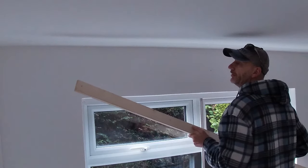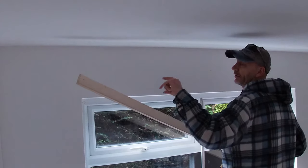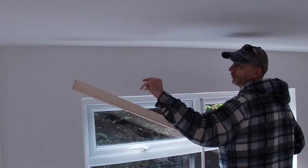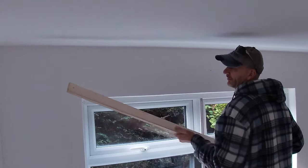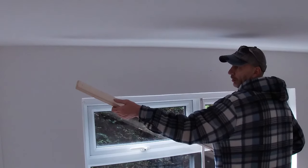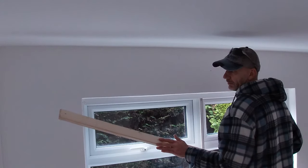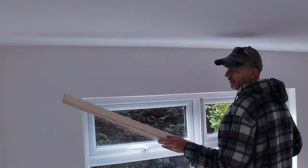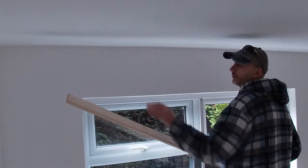So it's a lot easier this way, because you'll find that the curtain pole brackets, the holes for the fixings, are quite close together. If you disturb one, you're guaranteed to disturb the other. So it makes it awkward for mounting that way. So yeah, like I say, I'll drill all these holes and I shall countersink them at the same time. Just quickly countersink them and we'll get on with the actual drilling of the plaster.